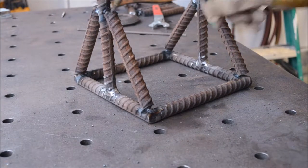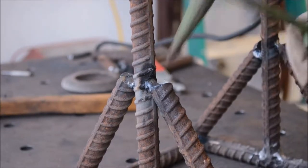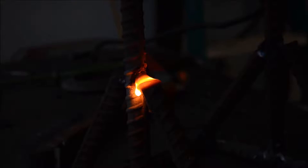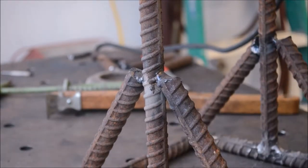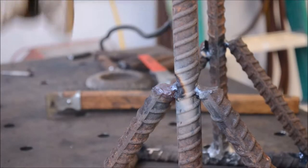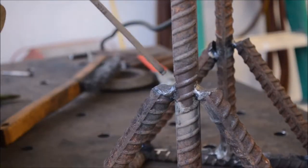That's why I used three-quarter inch rebar instead of half. I had some half-inch and some three-quarter, and also a stick of 1-inch, but I really didn't feel like having to grind through 1-inch rebar for all this cutting — and honestly that was overkill. Three-quarter is the right size: it's not going to bend like half-inch if you miss a hit, and it just gives you a sturdier product. Here I'm getting these little support legs welded on, doing more welding than I needed to, but I wanted to blend those tops in and make it look decent.